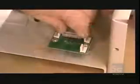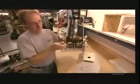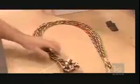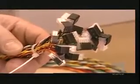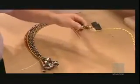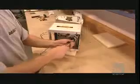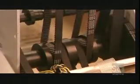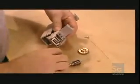They plug an electrical wire that links the gripper to the shoulder into a circuit board located in the shoulder. Then they screw the entire arm to the base. They link up the wires from the circuit board in the base to the motors in the shoulder. To do this, they have to bunch the wires, 48 of them in total, and thread them through the shaft that attaches the base to the arm. Once everything's connected, they fine-tune and test the gear and pulley systems to see if they run smoothly.